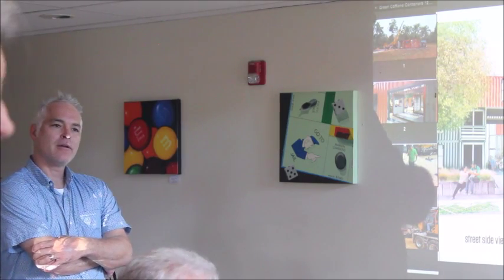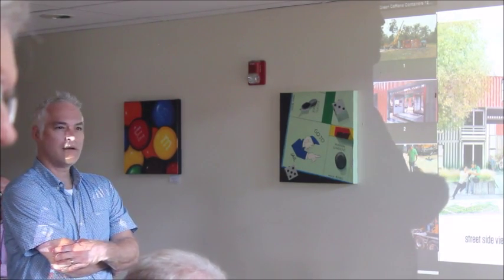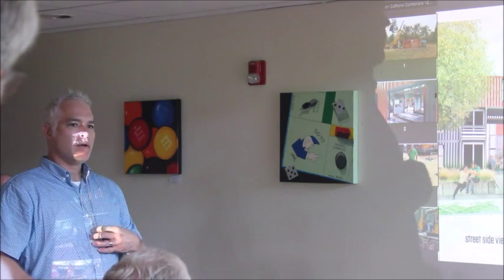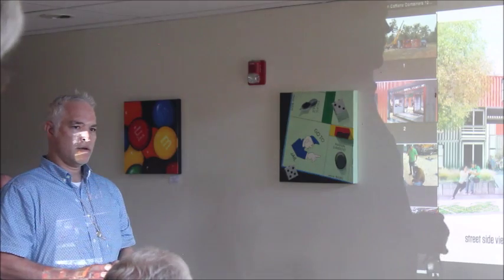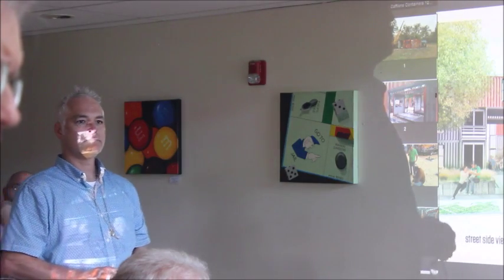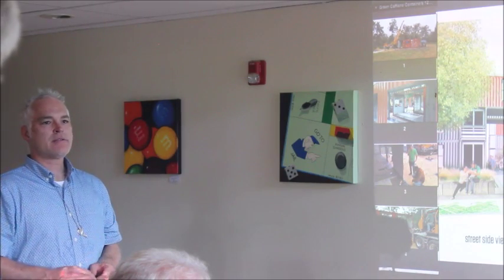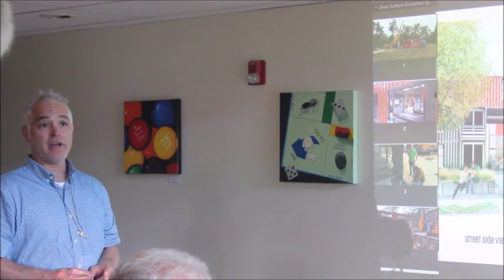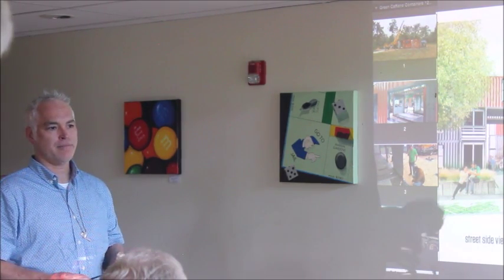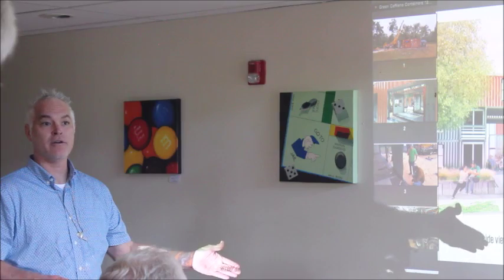And then the second question: in a development like this, it would seem advantageous to be able to build these things in a warehouse someplace and ship them out there. How are building departments as far as that? I was looking into it and thought there was a possibility of becoming licensed through a DCA, kind of like a mobile home manufacturer, and you could then do your own inspections of the units. But steel is largely a prefabricated element in buildings anyway. The building departments want to know that your welds are good and that you're using the right kind of steel, and so far they've been relying on the engineer.